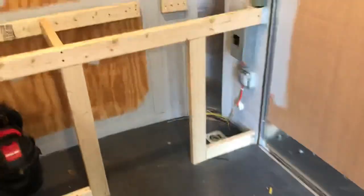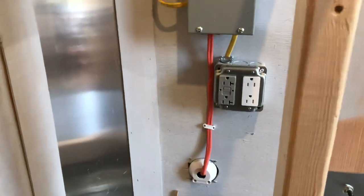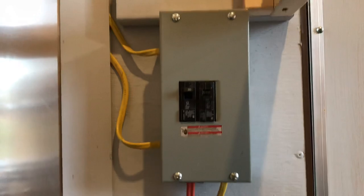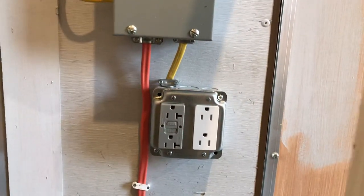I'll go ahead and take you all inside. Don't mind the mess — I haven't got any cabinets built yet, so that's why stuff's everywhere. This is all temporary, so don't pick it apart too bad in the comments. I still have to get back here and paint the wall. So that's where the power comes in. I've got 10-2 running to the panel for 30 amp — two breakers, one for receptacles, the other for lights. Got one receptacle that runs down here.